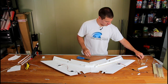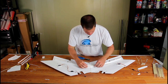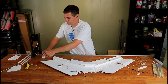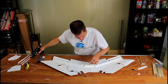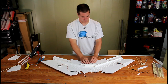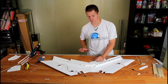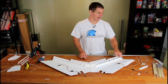Another good place for a spar is in the front, across from the rear one. And in the back of the airplane — when you crash, the motor is going to want to come forward into the aircraft, so putting a stitch bar across the back isn't a bad idea. Remember this is where the airplane gets quite thin, so you can't go right to the back — put it midway between the rear bar and the back edge.